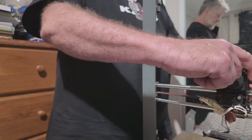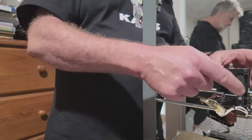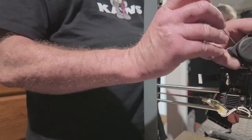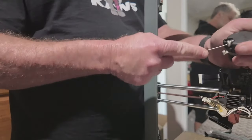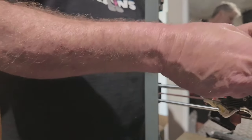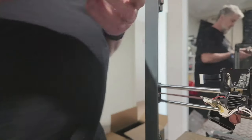That back plate is now off and you can get the extruder out now. Let's find out where the problem is. There's a problem in here. It has to be in the extruder - it's letting nothing through. It appears something's caught in the extruder, so I'm going to have to disconnect that and pull the extruder apart. It's not in the print head, so it's in the extruder - something's got caught.